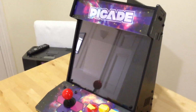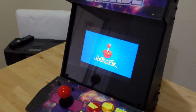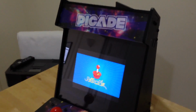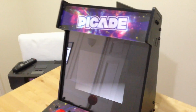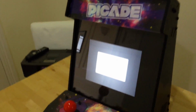Okay, so this HDMI force hot plug is the option you want to uncomment. So you remove the hash and it's done. There we go, got the RetroPie logo. And it should happily kick on. Otherwise you just see like a blue screen saying it's got power but there's no input. And that's it. So again, it's a completely clean 3.2.1 image of RetroPie.